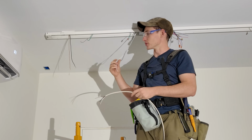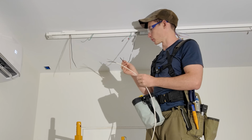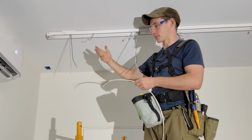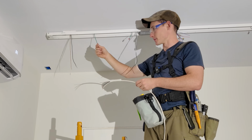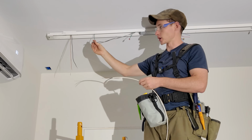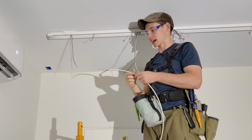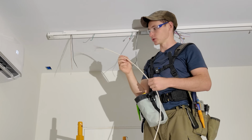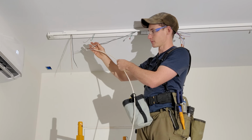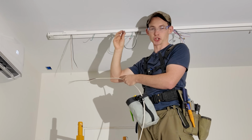With the housings hung up on the ceiling, now we got to do some wiring connections. This is how I am thinking we're gonna go about this. These are our wires coming out of the ceiling for our power supply. This is the ground coming off of the light fixture, and then these are the black and whites coming off of the LED driver. So obviously these have to get connected, but we have to extend this power to the next light down. So I have some regular old 14-2 Romex that we're gonna do like a 3-way connection here with probably a Wago connector, the lever locks, because we do have some stranded wire here.